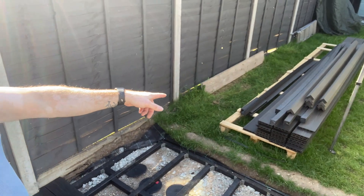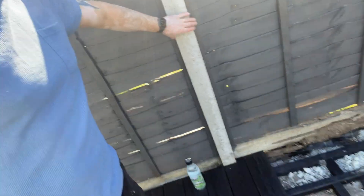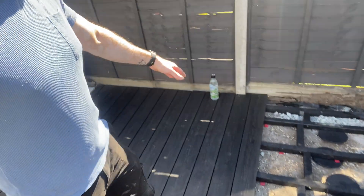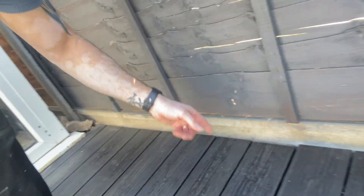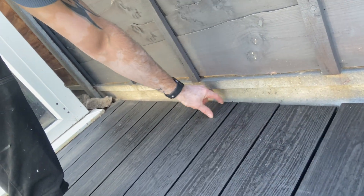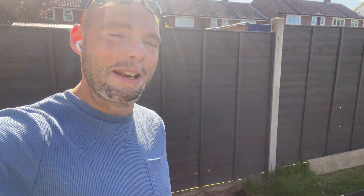Essentially what I'll be doing is putting that edge in on the deck, marking up where it's going to sit after taking into account any obstacles, then putting my plunge saw on a rail and simply chopping off all these overhanging bits across here — they'll fall down, pick them out, and put the trim down. I end up with a nice trim all the way through. Having that straight board across there is going to look much neater.